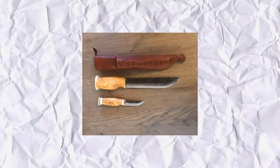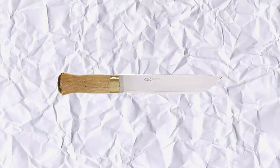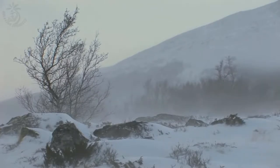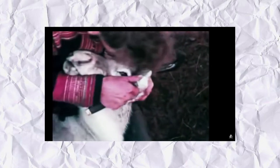Similar to the Magetan design, the larger Sami knives have many characteristics, such as the blade being made from laminated steel, as getting good metal was difficult. The handle was traditionally made from wood and reindeer horns — things we considered for our knife. Since the blade was meant for both rough and fine work such as chopping and shaping wood, as well as marking reindeer by cutting parts of the ears, we had to take into account that the blade isn't too hard, or else it would be too brittle.